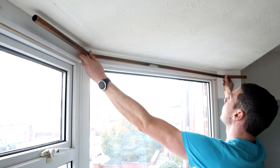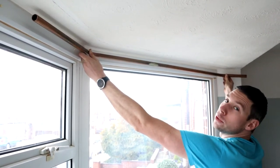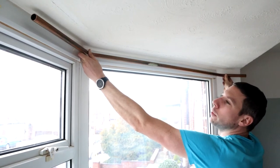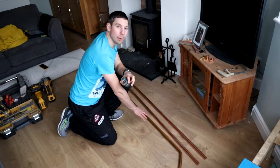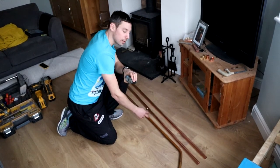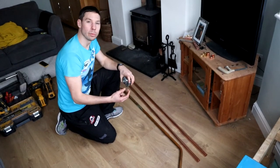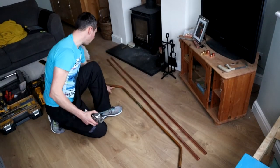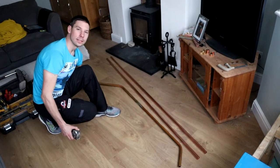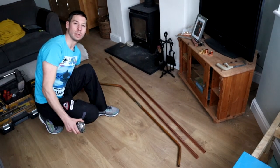This is what the template will look like once it's in the air. I'll take this template and these measurements and transfer them to two new pieces of pipe, and then we can fix them in the air. Now I've got my template and I'm happy with it — I've offered it up and it works — I'm going to create two more of these. The dimensions I used: I measured my reveal and one side of the window. That's my reveal measurement and the one side of the window. The remaining measurement doesn't matter — we can work that out later, it can be as long as it needs to be, and we can cut it down once we've got two templates together.